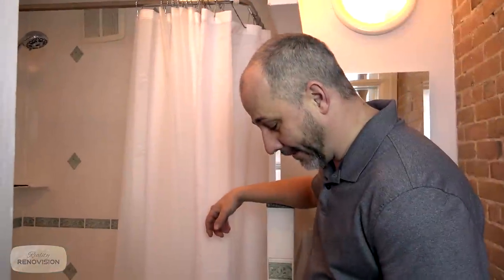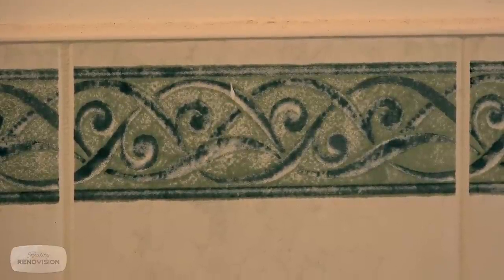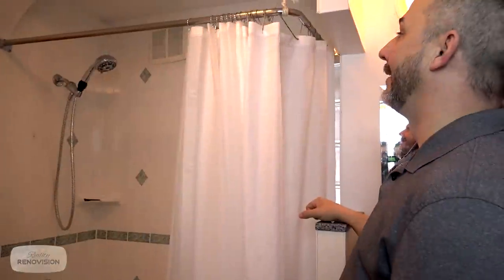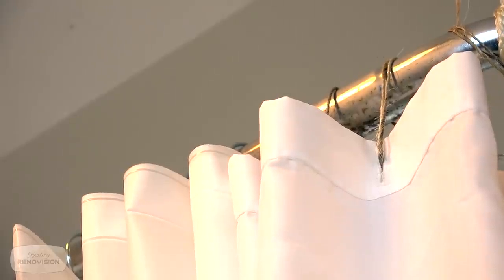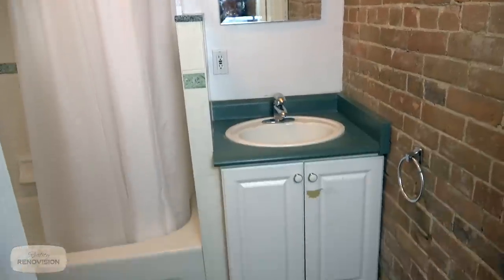This is the classic build-in-and-modernize-as-we-go approach. My guess looking at the date of this tile is that this was last done in the 70s, maybe even early 80s — forest green was huge back then. You can tell the tile is probably installed over top of the original mosaic. There are some mold issues going on; it was just tile over drywall with no waterproofing system. The client just moved in a couple of months ago and had to jimmy-rig a few things together.